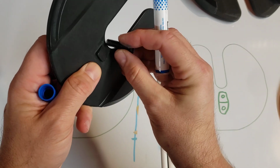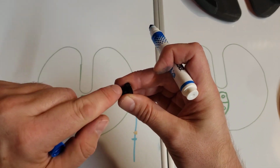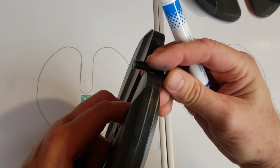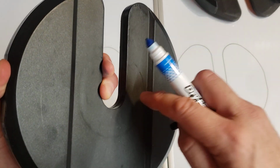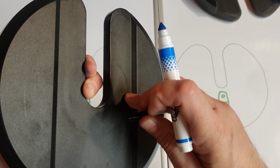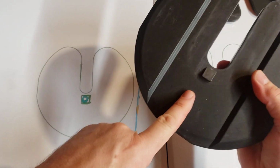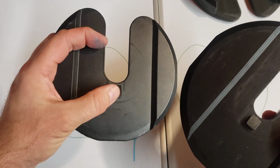And you can epoxy this in. You can tap it in on the bigger plates. Of course, it's easier. There's much more meat. See, this is thicker. So when you put this through, you're going to have much more meat to tap. So it's much easier to do the modification on these plates. And frankly, usually it's the big plates that shear their tabs. These lightweight plates almost never have that problem.